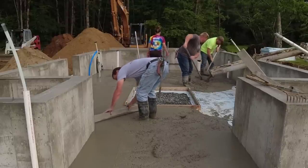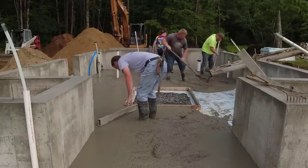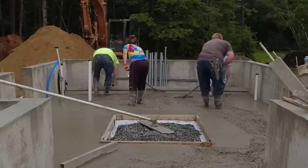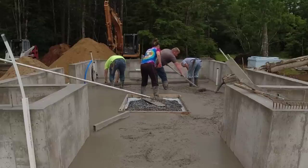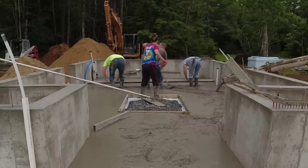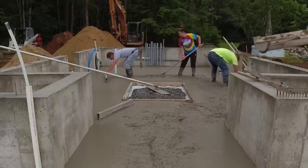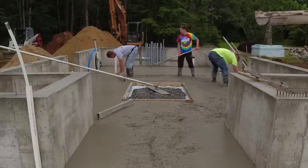We're basically pouring the floor around these drainage pits. For us, it's not too bad — business as usual, three and a half to four inch thick concrete floor. This one we got 4,000 PSI concrete with some fiber mesh in it. Didn't call for any wire, didn't call for any rebar, just the fiber mesh reinforcement with the 4,000 PSI concrete. We'll end up sawing a bunch of joints after we get all done.